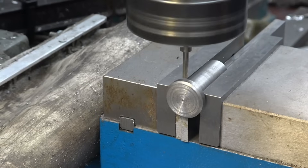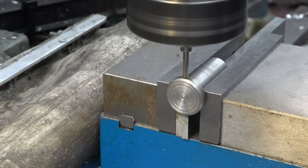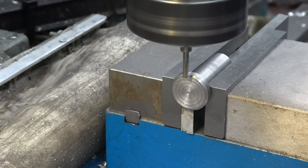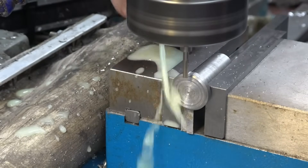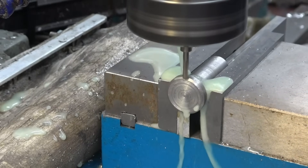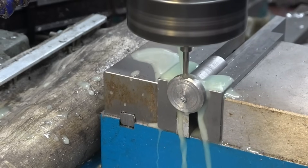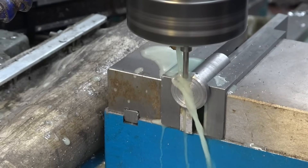I've got the machine running as fast as it'll go, which I think is about three to five thousand RPM. I've got safety goggles on because this milling cutter has only got one ambition in life, and that really is to snap off. Taking tiny little cuts — I'll put some water on it as well, giving it a fighting chance. A quarter of a mil cut, that's all — no more. It's not a big machine but it's big enough, and you haven't got much feel when you're using something as small as this.